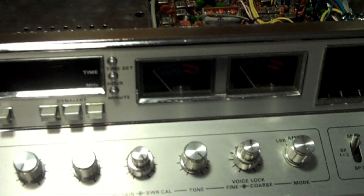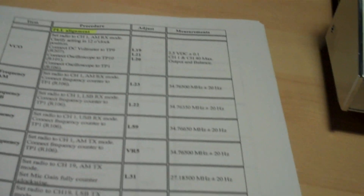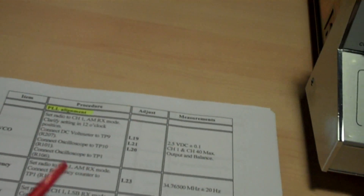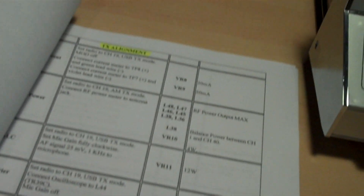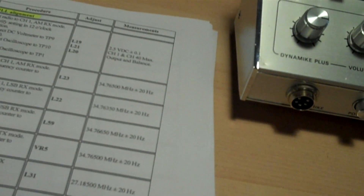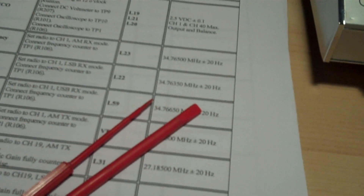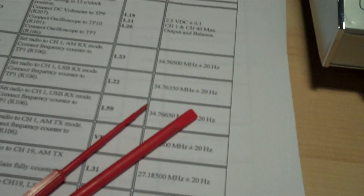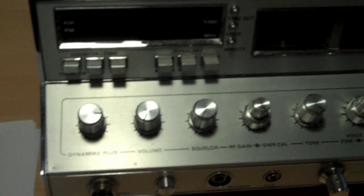You'll also need procedures. If you have the gear, you'll need procedures as to what to do, and they're readily available on the internet. If you can't find them, you can email me and I can get those out to you. There are VCO and PLL alignments, transmitter TX alignments, and RX alignments. You'll also need some non-metal tuning wands. That's basically all our prerequisites — stay tuned.